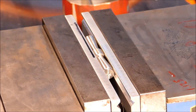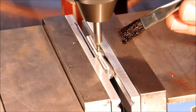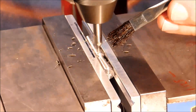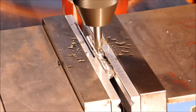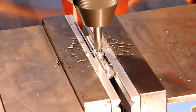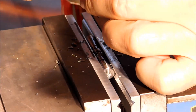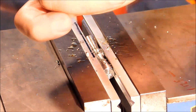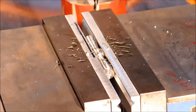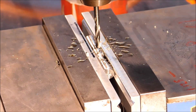I'm going to line the entire thing up by eye — 250 pin in the chuck. Don't forget you're drilling across the center hole here, so be careful. Make sure that the cross hole is about 10 thousandths of an inch bigger than the biggest tap you think you're going to use. I'm putting a 149 hole in here — that should be fine all the way up to probably a number five or number six.